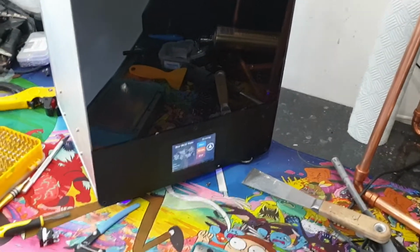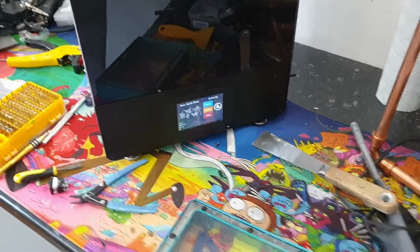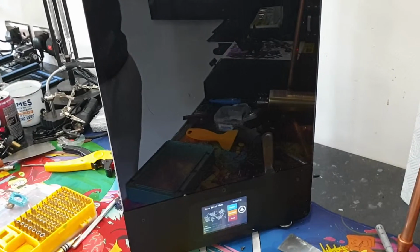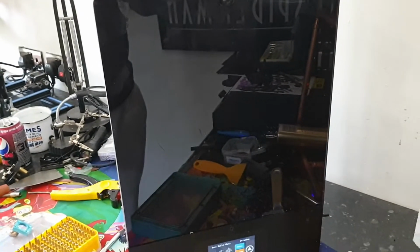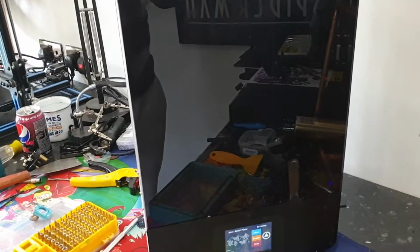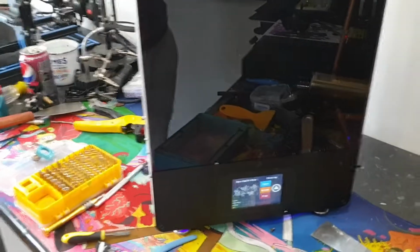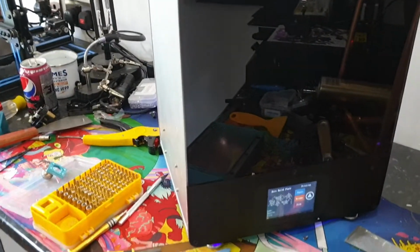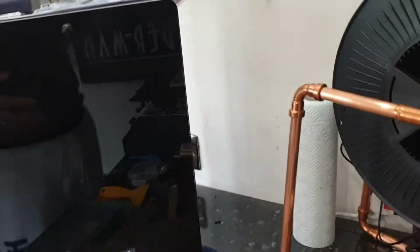They were very responsive. An engineer spoke to me. We did a number of tests. We did some dry prints, rather than wasting resin, to see whether it was going to be, oh yeah, you've definitely got an issue with the model, or there's definitely an issue with the UV or whatever. I got a multimeter out. Originally, I thought it was going to end up being the external power brick, that maybe it was fluctuating, that was causing it to reset.